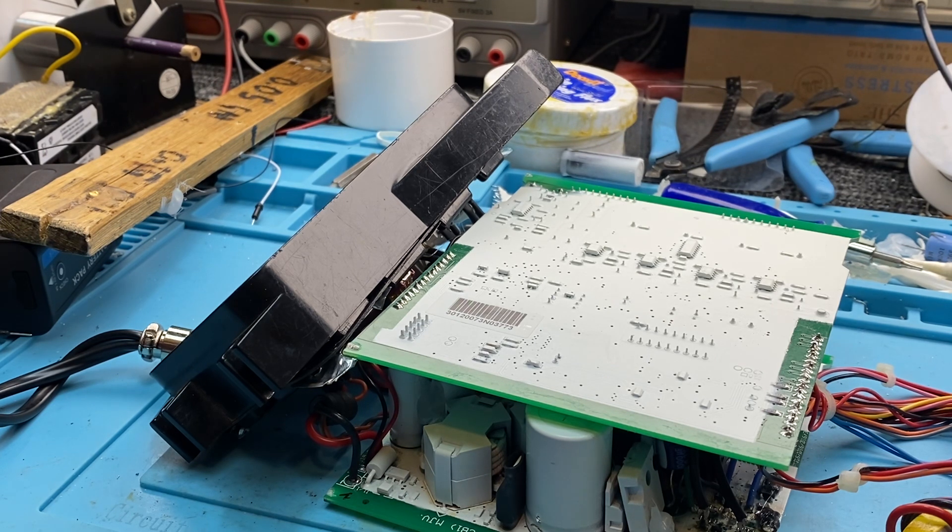It's easy enough to do if you know what you're doing, but I wouldn't advise just anyone to attempt it. You need the coil properly configured and you need to change the coil connector so you can't mistakenly put a mono back in and blow things up. You could make a four-quadrant coil and utilise the existing system in a double-D configuration just to see how it goes. I'm not in the business of making exotic coils, but I have made some recently — really good ones.